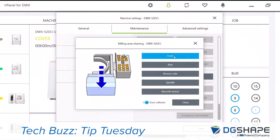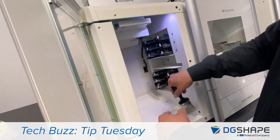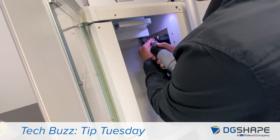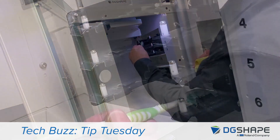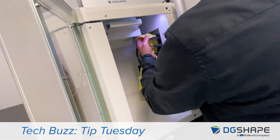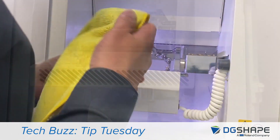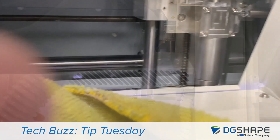Let's perform maintenance. Go ahead and use the functions from vPanel — click all the buttons to ensure that you are going through the right procedures. This information will also be logged in the system. Suction all milling zirconia within the traverser, then wipe down and clean. Use a fine brush to get into those tight areas and remove any zirconia that can impede the flow of the adapters into position. Wipe down very well. Clean the ATC unit and the C-clamp. Remove any milling waste within the spindle area and wipe it down.